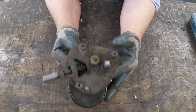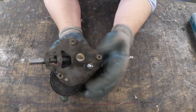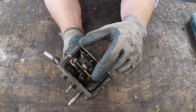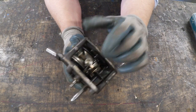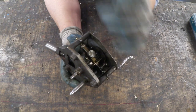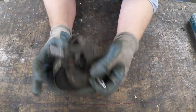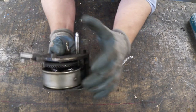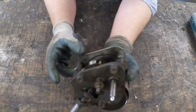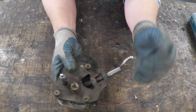So there it is — isn't it a beautiful mechanism? This is the main drive spindle that turned the 78. This is like an on/off switch; it moves a little pad against this governor wheel, and once that pad is pressed against the wheel it won't run. When you flip it, the pad moves away and the governor maintains 78 rpm. There's the wind handle, and that is the main spring, packed with a load of grease. It's a lovely thing.